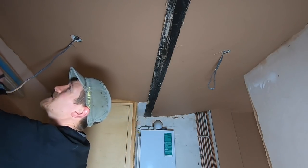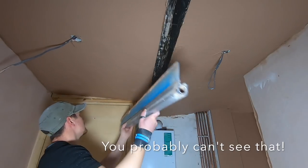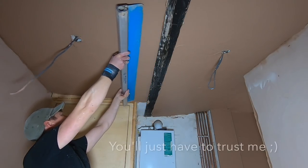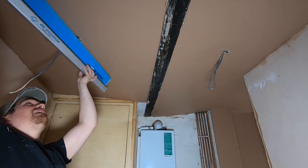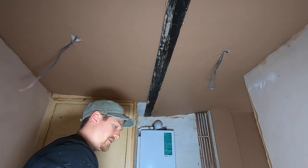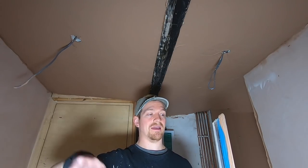As you can see, it really does flatten the ceiling, especially on a ceiling that's, well, flat. It's really good. So if you get a chance to use a speed skim, I'd definitely give it a go, especially when you're doing it on top of bonding, because it does help. Just get a speed skim everywhere. That means once you've used it, you can go directly with the second coat onto it. It's perfect. It's a good old product. That's what I recommend.